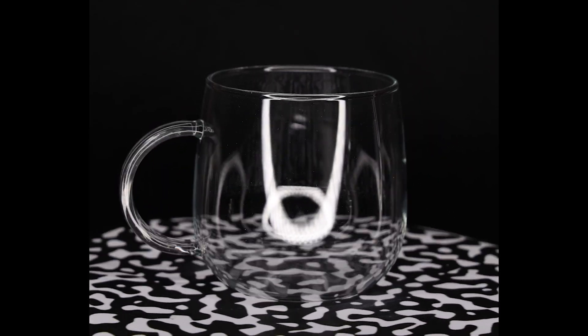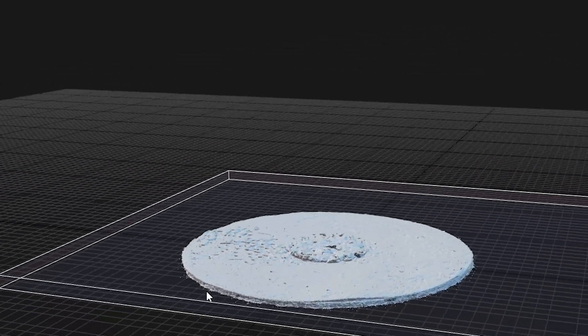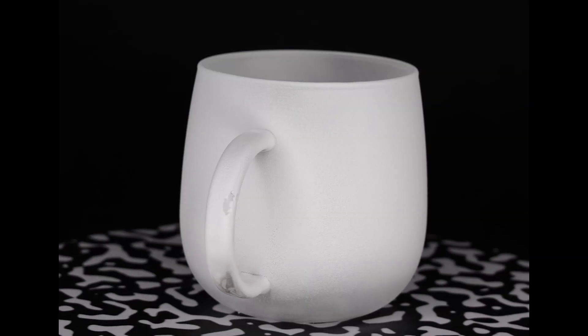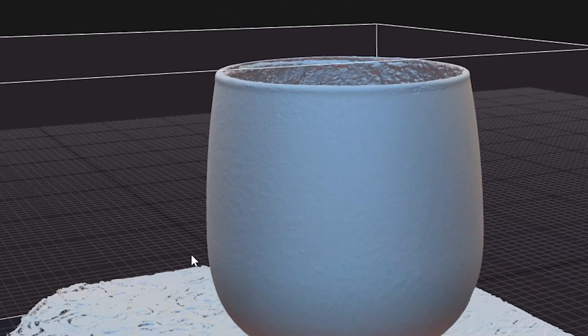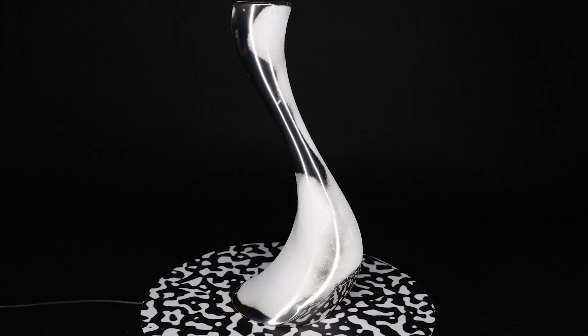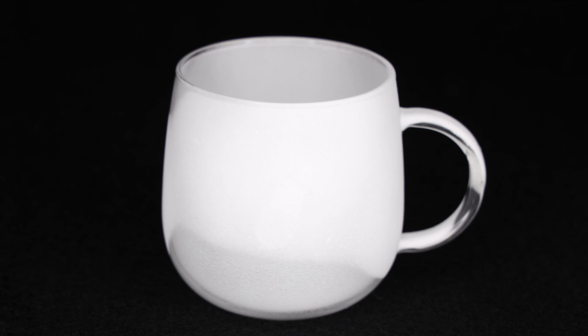The second part I tried it on was this glass. I scanned it without the spray, and the result shows the scanning software is basically not able to detect it at all — it's invisible to the software because it's super transparent. By using the scanning spray on the surface, we get a really nice, very clean result, except for a few points where I probably didn't apply quite enough spray. And looking at these time lapses, you can really see the spray disappearing like magic into the air over time, not leaving any traces on the part.